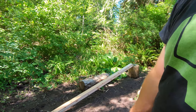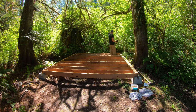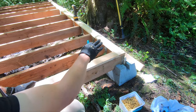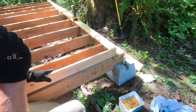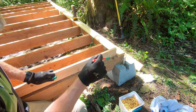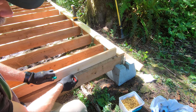I'm going to take this board and transfer the marks onto each one of these joists so I can lay the decking out right across. Actually, first I'm going to screw down my end board so I have something to measure from. Got my end piece screwed down — I'm going along marking where these boards will go, using my marking piece. You can see each successive mark is a little further in from the previous one.